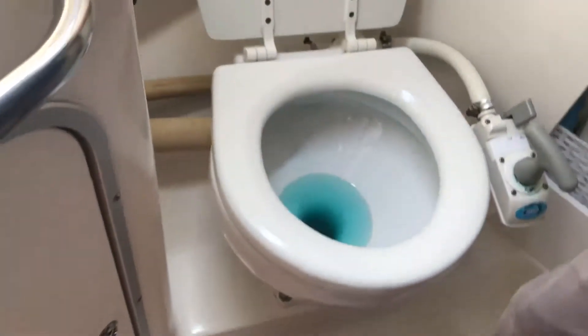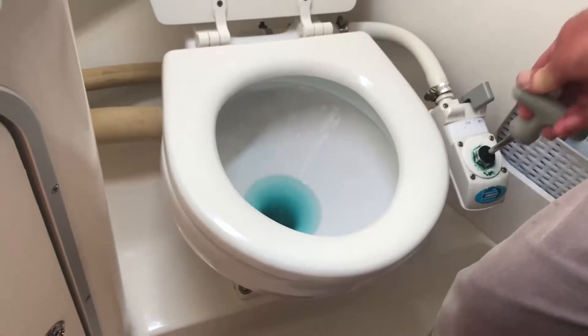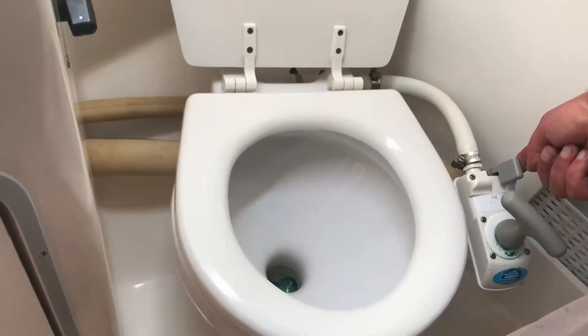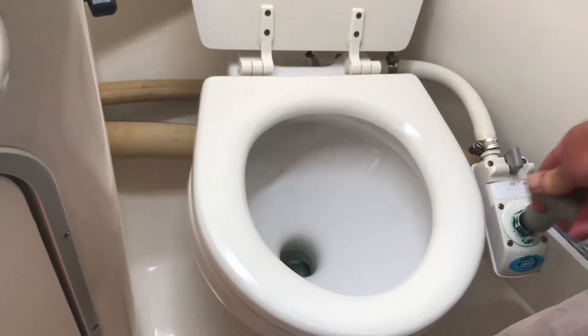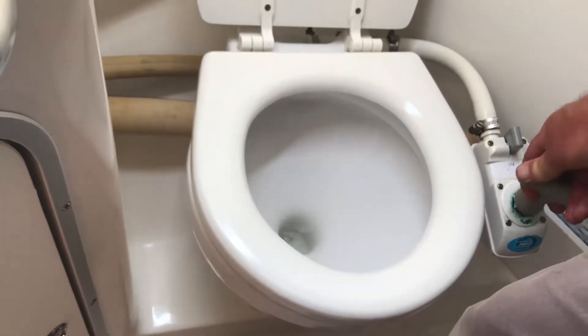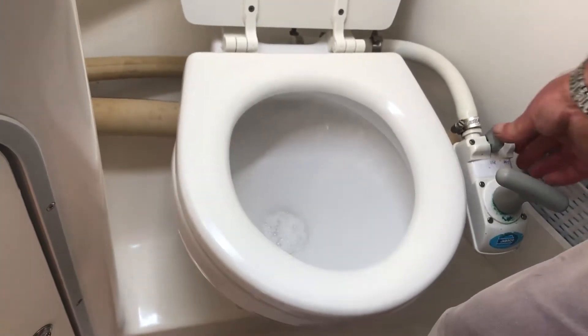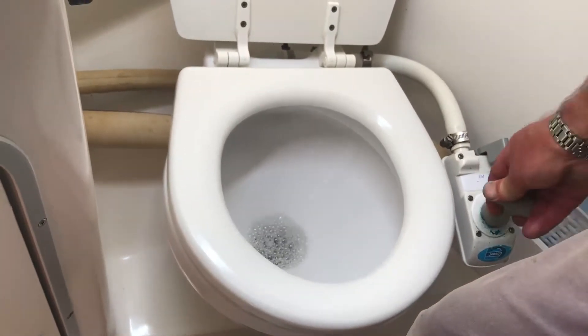Okay, let's take a look at the heads — the loo. The loo is very straightforward, nothing to be scared of. We have this pump here with a little lever. Do your business, then push the little lever to the flush position and go for it — give it a good 20 pumps, get lots of water going, get a really good flush. Having flushed it away, shove the little lever back to the dry bowl position and pump out that water. We leave the loo in the dry bowl position. Nice and simple.